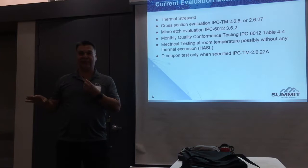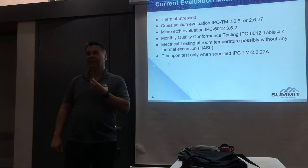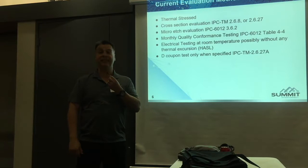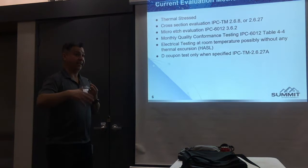We do a lot of tests on boards — a common trigger I see is when boards have been run through reflow and they want to retest for any new opens. They think if they reheat it and bring it back to room temperature and test it at room temperature, they'll find the defect. You will not see the defect. We can make more money testing boards this way — they'll all pass. You won't find it. And when I see that, I realize somebody has a design problem.